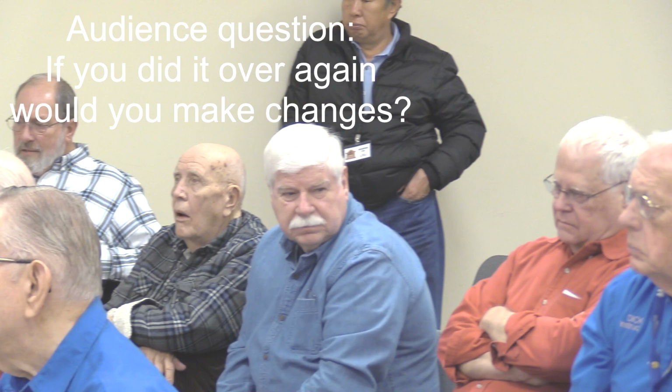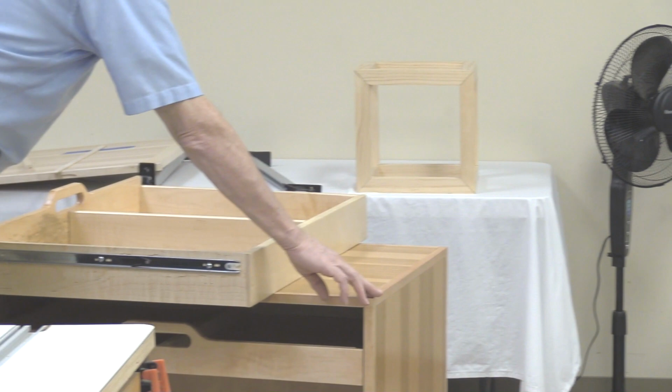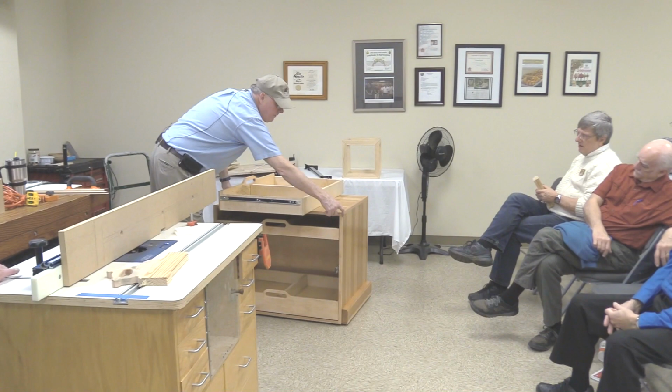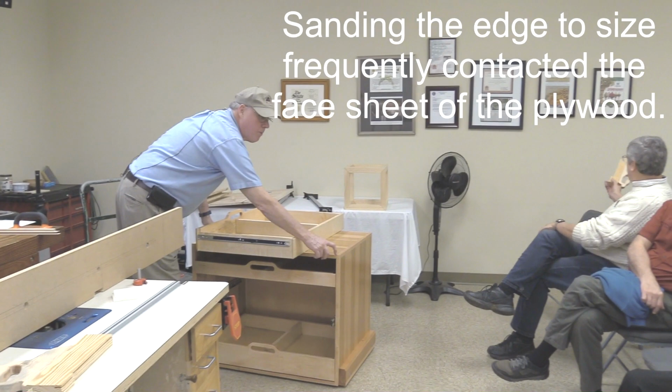Multi-purpose. Is there any major thing that next time you build one of these, you would do differently? Yes. As I said earlier, these spline deals here. I think we did a good job of hiding it under the rail, but you will see some bleed through. Also, if you want to get really picky in flattening these, you'll see there's a little more gap in the top than there should be. It's not perfect, but it's close.